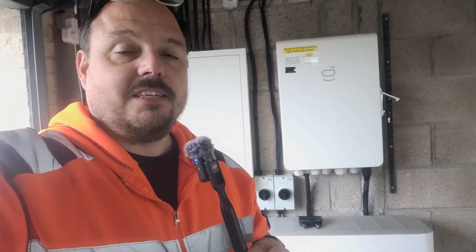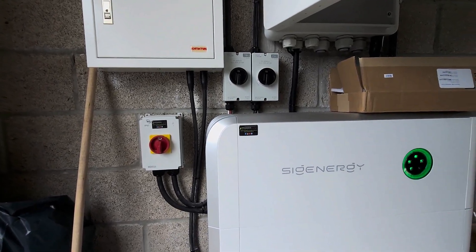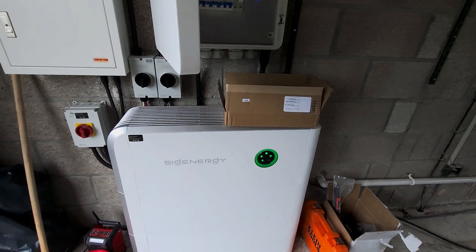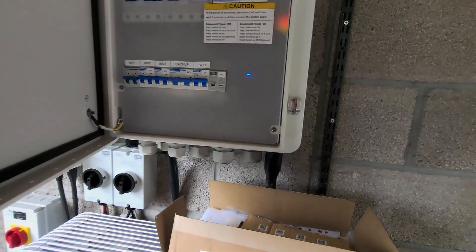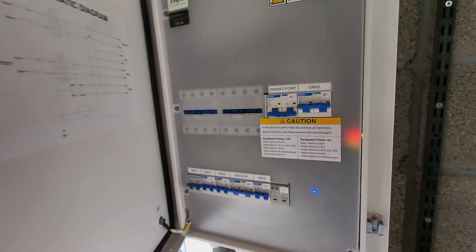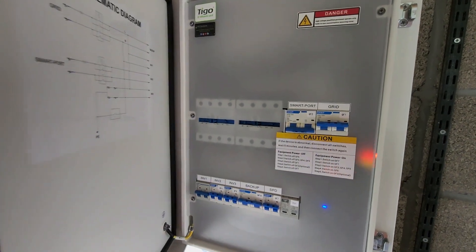Dropping down a bit lower, you can see we've got all of the inverter neatly tidied away. This is now 16kWh of storage with a 10kW inverter, whole home backup, full isolation. These are the four-pole isolators from IMO, so they'll do two strings in one inverter — brilliant for switching more than one string. We've kind of done it on roof aspect faces to limit the number of switchgear on show with four strings, while still leaving some redundancy in the system.